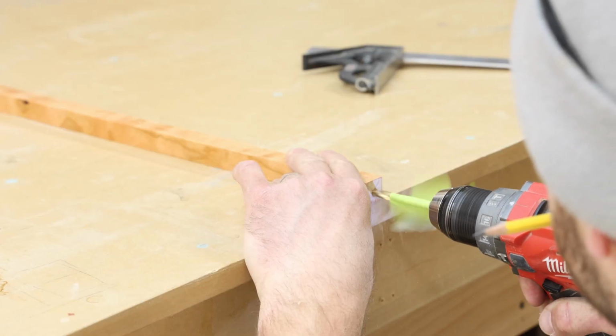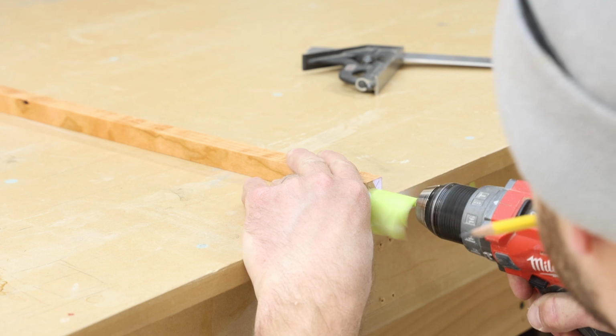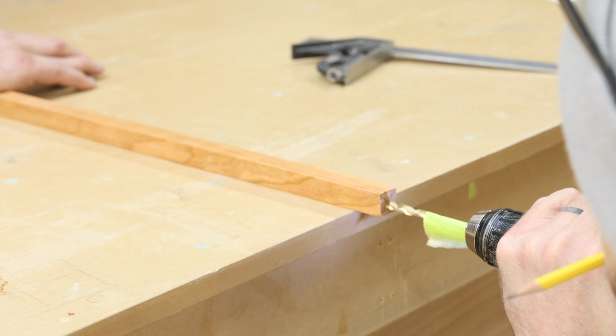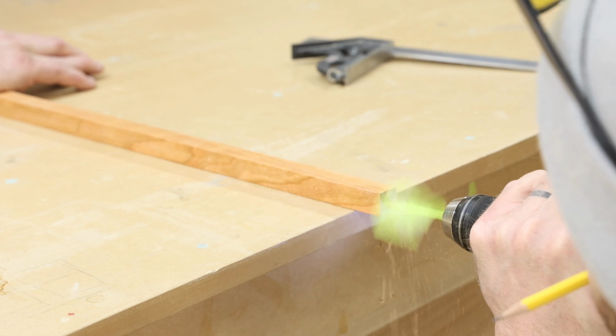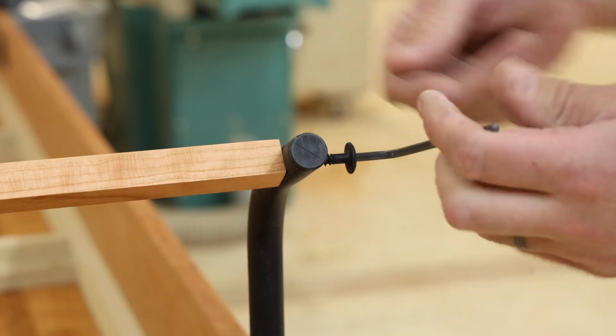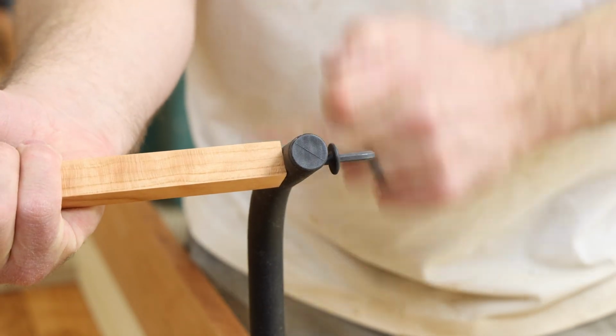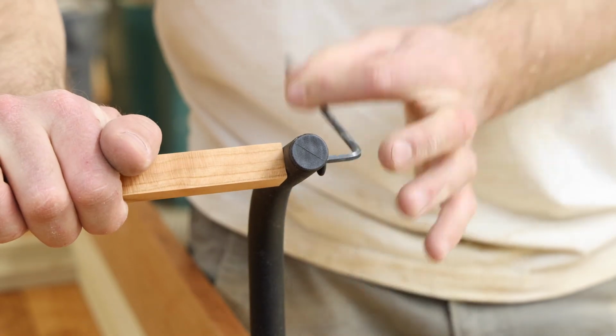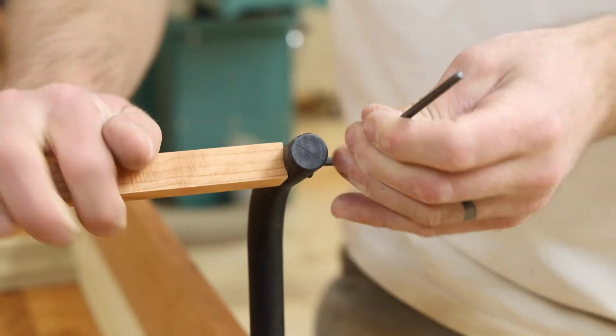And then this piece is for the pivoting legs, to connect the pivoting legs. I think I missed this step earlier. Supposed to do it earlier, but doesn't matter. So drill that 1/4 inch hole, 1.5 inches deep, and then these just get threaded on with some big screws that they provide you with.